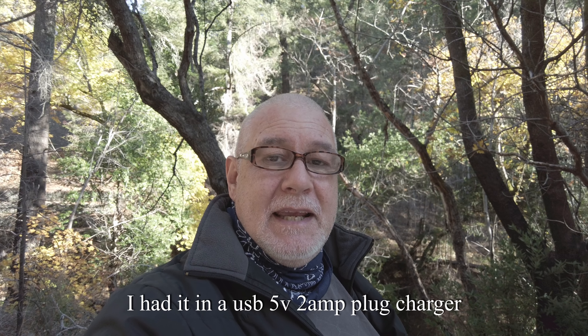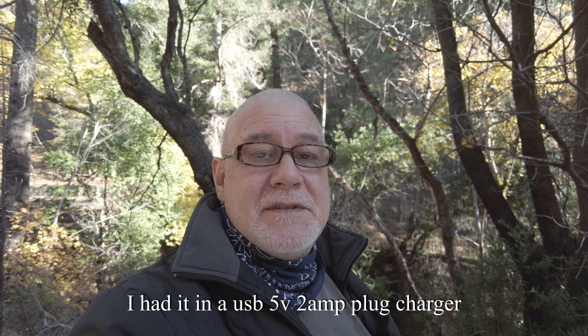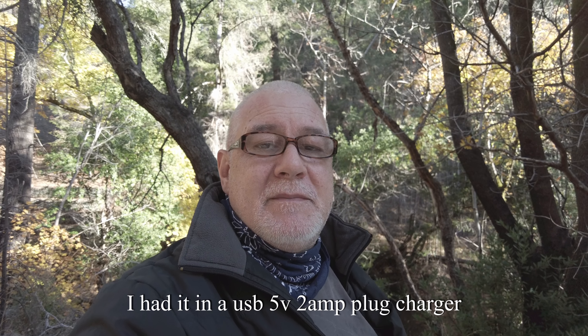Just to go over more of the Pocket 2 — the battery doesn't last very long, it's about an hour and a half, which is kind of okay. But you can plug in USB. I've kind of tested that — I want to talk to DJI more about it, but I believe a USB power source will plug into this thing just fine and keep it powered up. I've actually powered it into a USB and it charged while I was shooting, so I don't see why you couldn't do a 5-volt USB into this.